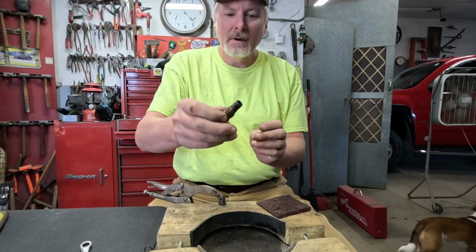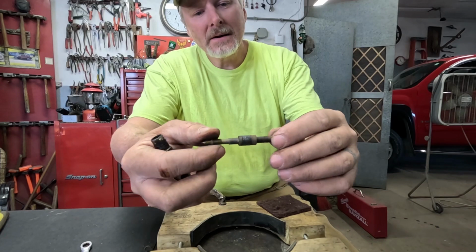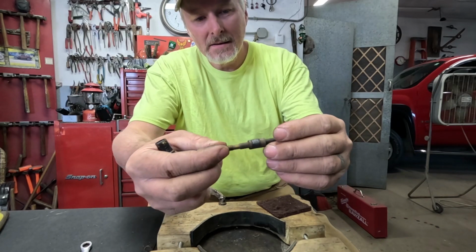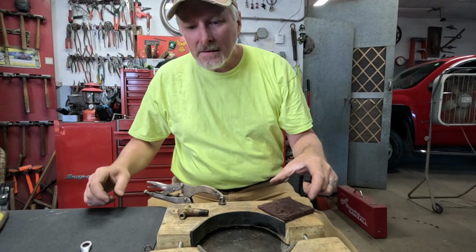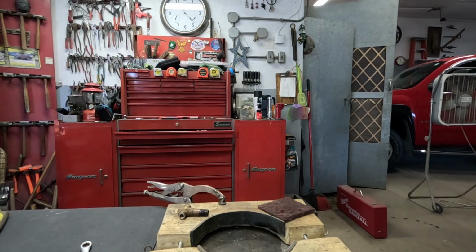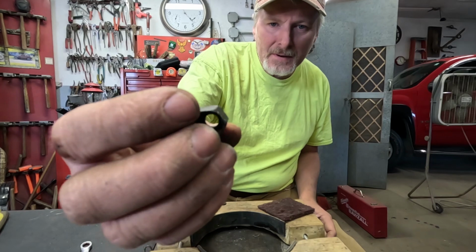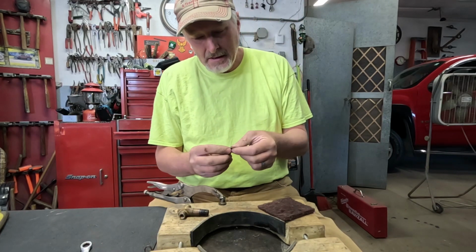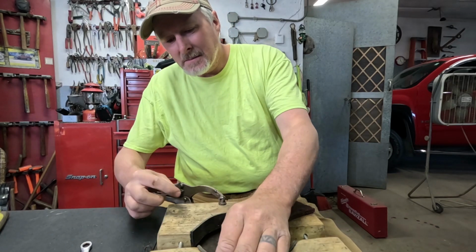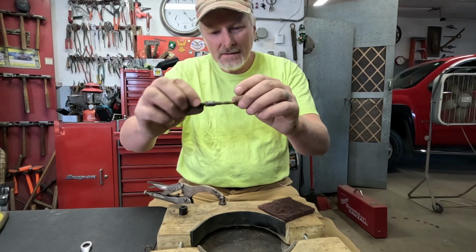Okay, that's still a little warm. I got everything apart there. I even threaded the packing clear out of there. It doesn't look that bad. I must not have brought that nut back over here. You could definitely see that it had been leaking around the packing and dripping fuel out the bottom of that, but it doesn't look that terrible now. That packing, I've seen worse than that. Maybe they just didn't have it snugged down tight enough.